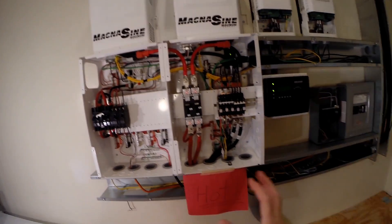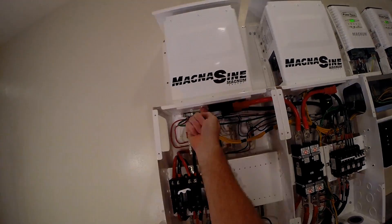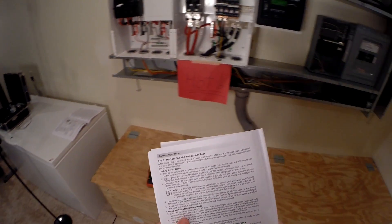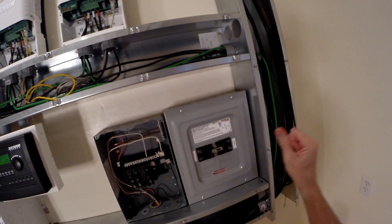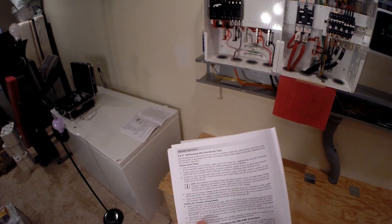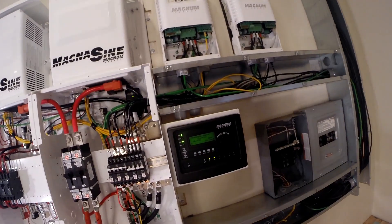The next thing I want to do is have the inverter pass the AC power through, drive the light bulbs, and charge the batteries. Press and release the master inverter on/off switch to turn off all the inverters — okay, they're off. Apply AC power to the inverters — that's my 60 amps coming over, and this will turn on the two inverters. In about 15 seconds it should turn on these lights. There we go — we're charging!